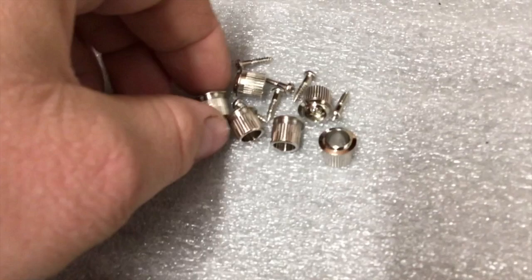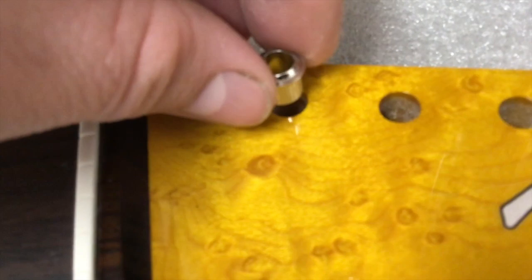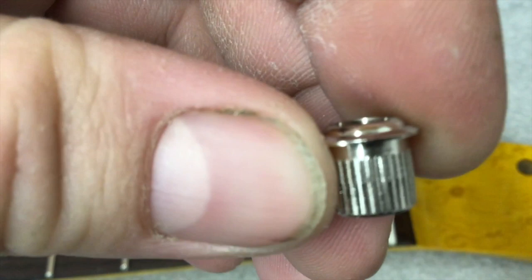It's a 3/8 reamer, which is a little oversized, but it's going to allow me to taper these holes to accept these ferrules without cracking the lacquer around where they go in. And also, I'm going to taper them just so that they slide in and press in just the last little bit, maybe, for instance, the distance of the non-spline part of that insert.